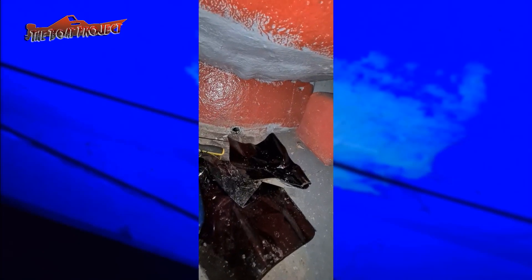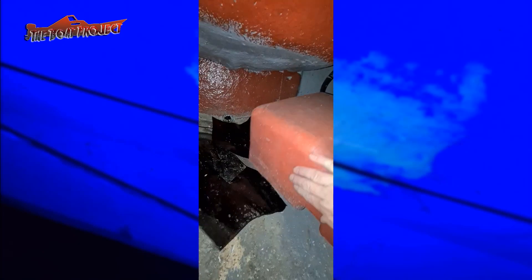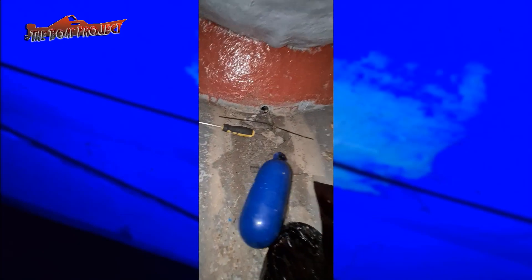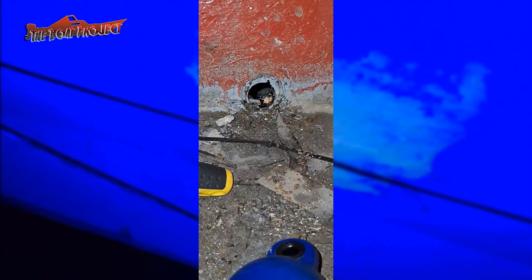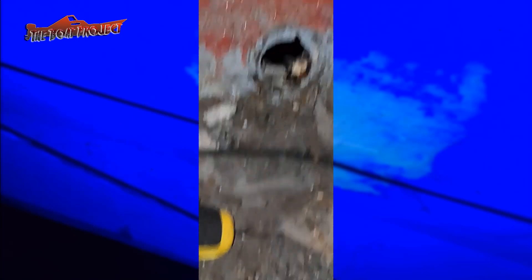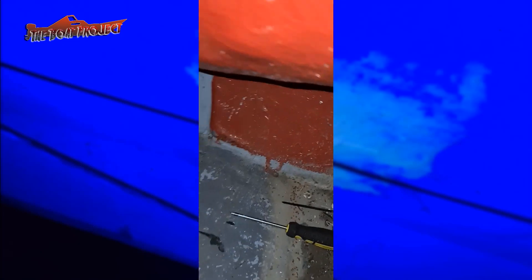It came with a big fuel tank. It's nice that the bilge outlet's already installed. And wow, looking right at the back you can see the transom hole — it's basically filled with compost. There's nothing solid in there, so that's all got to come out and get replaced.